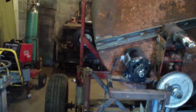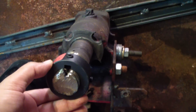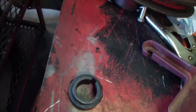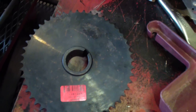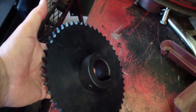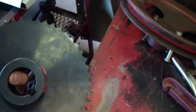I bought a hub and sprocket from Tractor Supply. This is the hub to the gear which goes on there, and then the sprocket. They sell them separately so you can change out different hubs — this is an inch-and-a-half hub, the biggest I can get. You can put different-sized sprockets with different hubs in them, and then you weld it around, and that gives you your sprocket. It's a number 40.